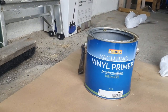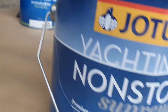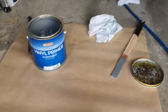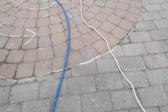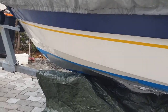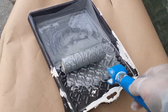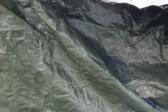My tip is: first apply the primer, and second go with the anti-fouling. That's the best approach. The color looks like that, and as you see I'll show you under the boat — it looks like a primer. It's better to use a roller to paint on there.